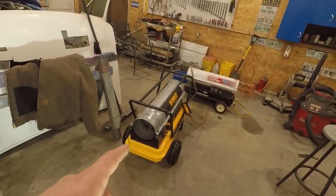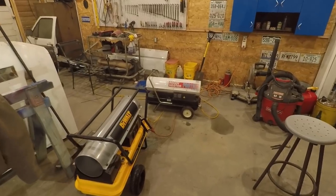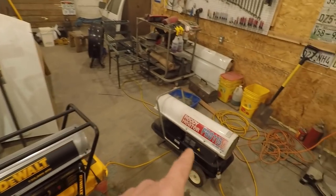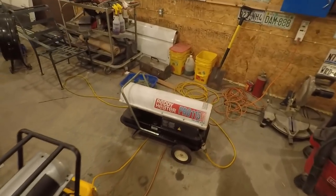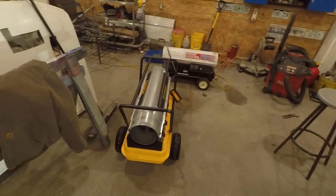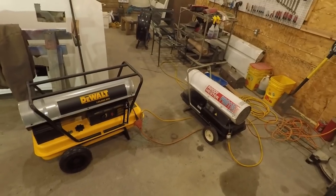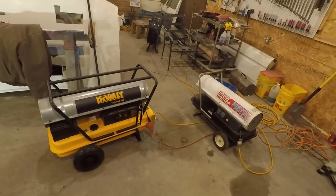This one is burning a lot hotter than that one. Looking at it next to this one, the old one just looks like it isn't running quite right — maybe it needs the pressure turned up a little bit or something. It's never been adjusted. The front of this DeWalt one glows pretty hot red; the old one, not so much. Put your hand out in front of this one about three feet and you can't hold it there too long — on the old one you can. Maybe this one hasn't been running quite up to snuff for a while. I believe each one of these burns about a gallon an hour running non-stop, so when they're both running I'm burning twice as much fuel. But if it takes a fraction of the time to warm it up, that should save on fuel a little bit.